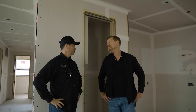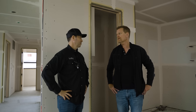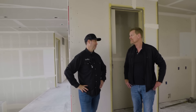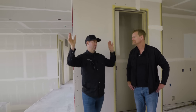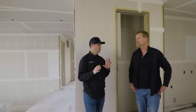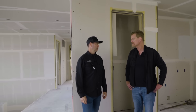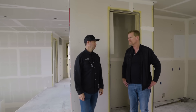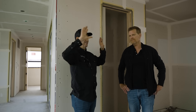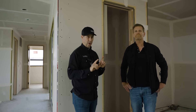Anything we missed from a builder's perspective on the trimless? Yes — a hidden cost is for the drywaller. It's $100 per can to float out each light. We have 130 cans, so that's $13,000. I'm assuming that's because they end up basically solid-floating these ceilings to make sure there are no issues. Are you normally doing a level four or level five? It's a level five, but this particular home it's called a 'cottage texture' — imperfect smooth some people call it — very close to smooth wall with minor imperfections. But they're floating from can to can to get it all even.